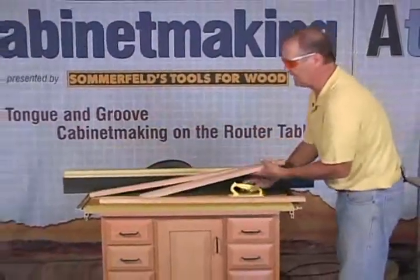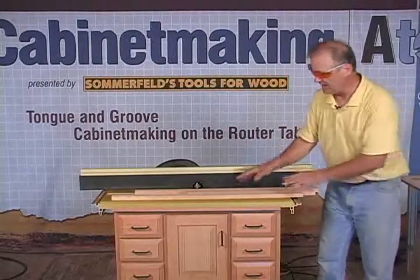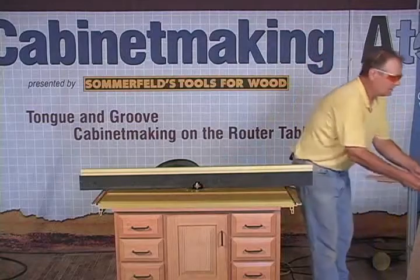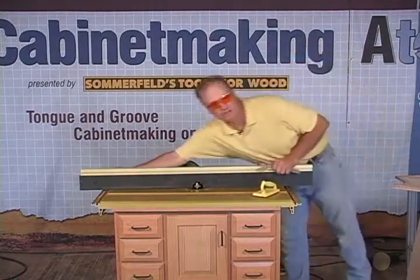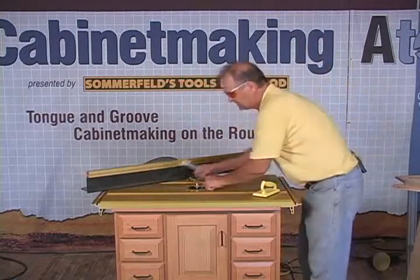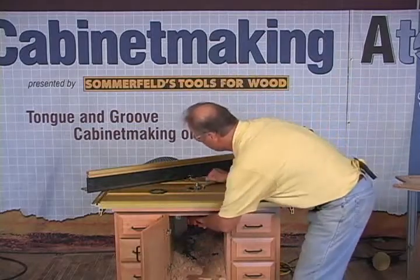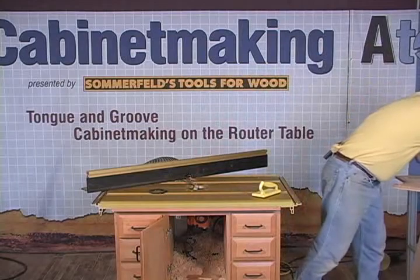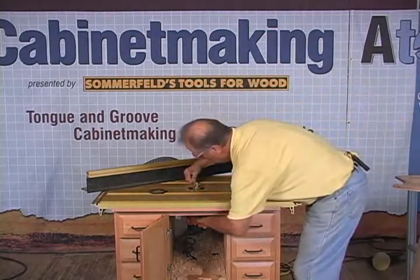Okay, we've got all of our grooves cut, and make sure that you keep the good side up. Don't get those mixed up. Put an X on the top. Okay, now the next thing we're going to do is we're going to change bits and put the tongue cutter in. Again, after building this cabinet, you know how easy this is to do. We'll just come into here, pop this bit out, bring the tongue cutter in, and we're ready to go.